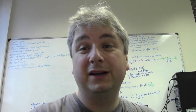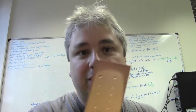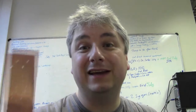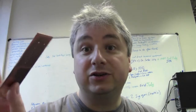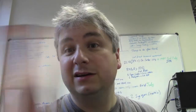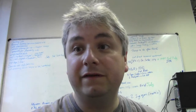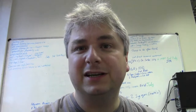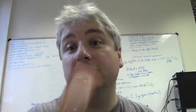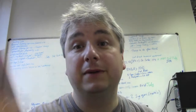Copper brightener is an additive that you add to your electrolyte, and it improves plating performance. It evens out the plating and stops your boards from getting dull. Now, just because it's dull doesn't mean it's crap. It's perfectly fine. It's copper, it's just a matte finish, no biggie. It may not look as nice as the polished copper, but it still does the job.